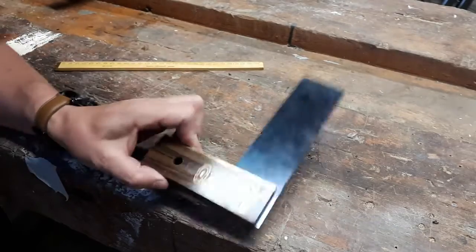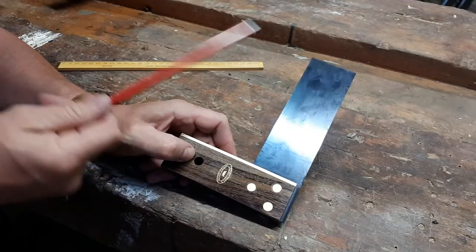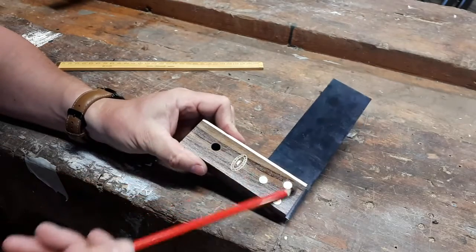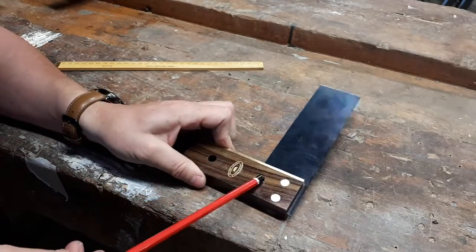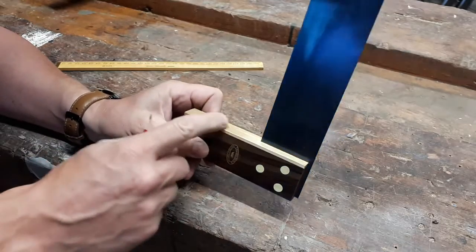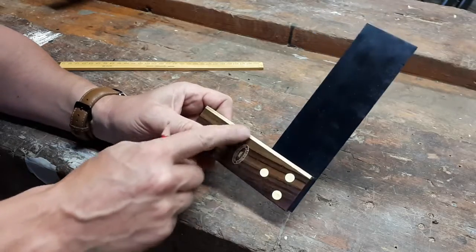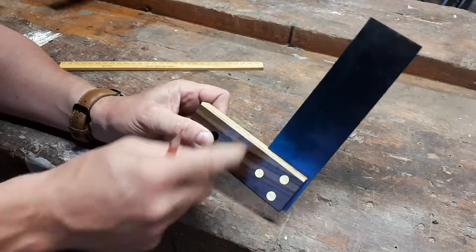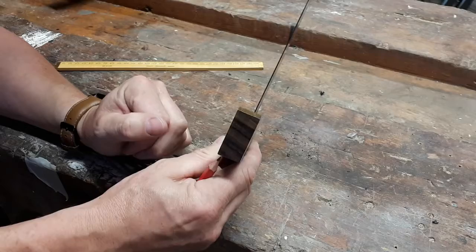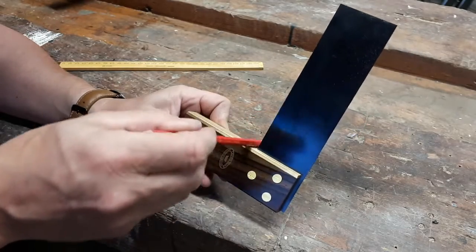The other piece of equipment that we're using is the tri-square, and a few key parts about the tri-square. This part here is called the blade. It's a lot thinner. And this piece here is called the stock. These are the locking nuts, or the locking rivets. And you can see from the colour here as well, this material is brass again. And again, the brass is used on top of the wood there to prevent the wood from wearing around and deteriorating. It keeps a nice square edge, or 90 degrees edge on the tri-square. And the angle between here and here is 90 degrees.